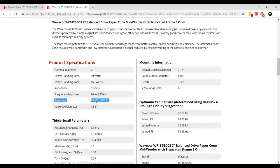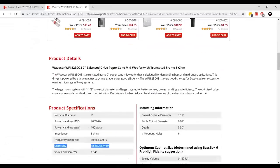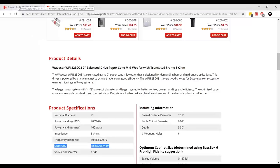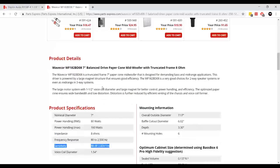That's a five-and-a-half decibel difference, which is a big difference — and that's before we even account for things like baffle step loss. Realistically, this tweeter could be playing significantly louder than the woofer. We don't want that; we want the tweeter and woofer to play at roughly the same sensitivity. That's what an L-pad is for.